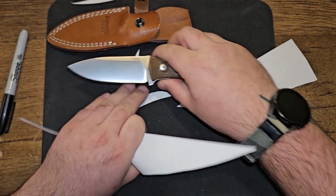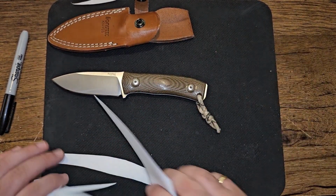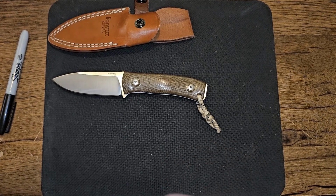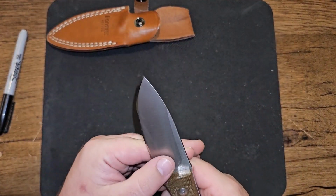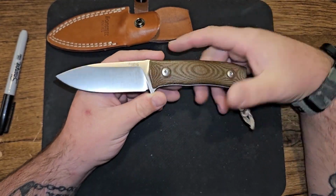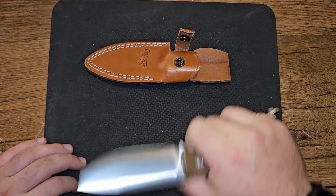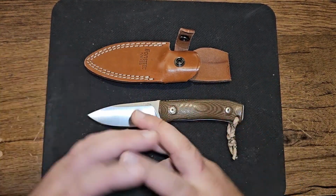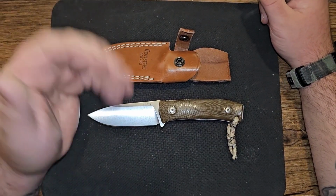Essentially, I took this knife and when I checked the bevel on it, I found it was at about a 25-degree angle. So what I did was I took it down to a 22-degree edge, and I was able to get such a good result with just using that sharpening system. And I want you guys to know, some of you that are newer to the knife thing and are worried about having to resharpen, that stand-up manual kit is only $124 on Amazon right now.